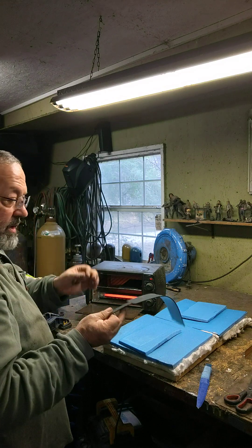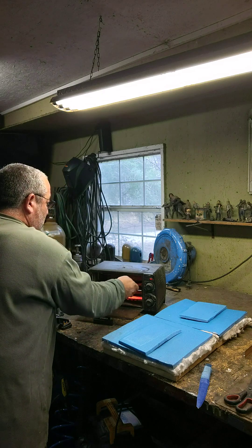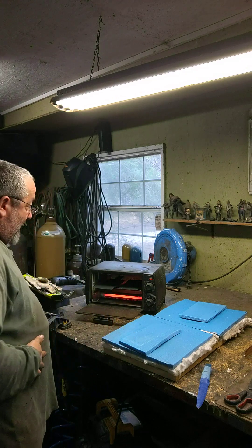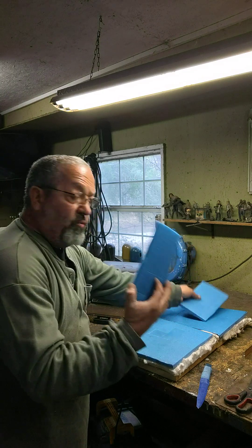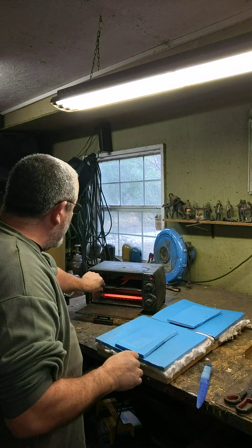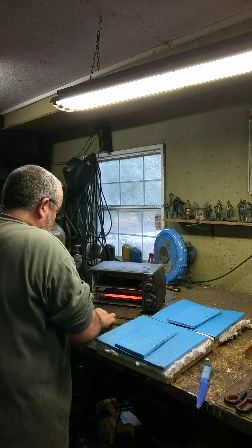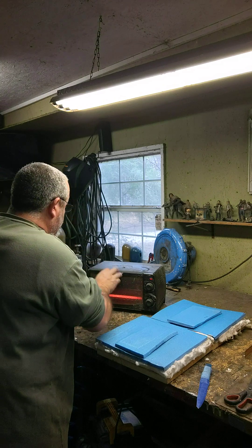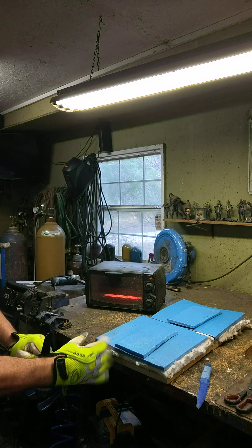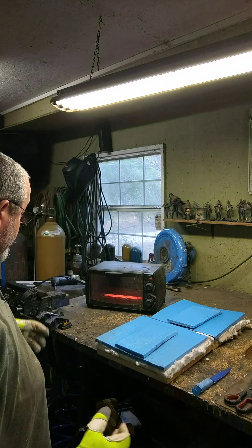You want to check your Kydex and you see it's already getting floppy — that's what you want to see. You're going to spin that piece around, spin this piece around, and let them both get hot. So I have the two pieces of foam that's going to be the pressing foam. Once this comes out of the oven, you've really got to work pretty quick with it. I'm going to close the door just a little bit to get a little bit of heat to stay in there, that way they both heat up the same amount. Now this part's going to move fast, so if I start stammering a little bit, it's just because I've got to get it done real quick.